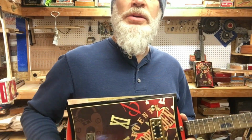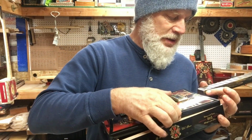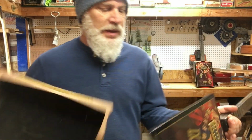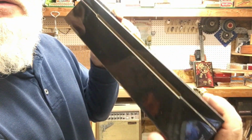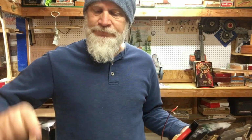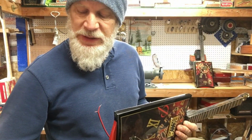It's either no hinge, or I can put the hinge on and it won't be connected. And so that's what I opted for. What I opted for was to put the hinge on here. That way when you're looking at it from the top, you can actually see that there's not a gap. If there is no hinge, then you're going to see this gap right here. And, you know, I guess that's okay. Not that big of a deal. But I think having the hinge in and being able to see the hinge is actually going to be better.